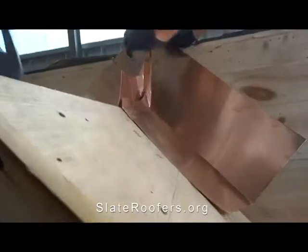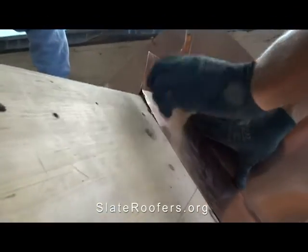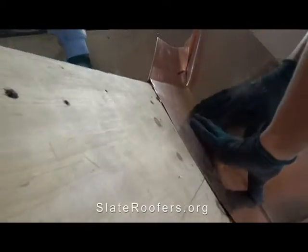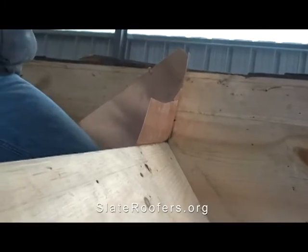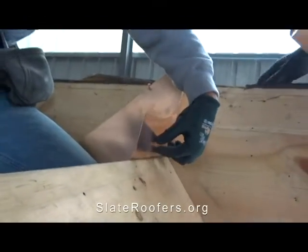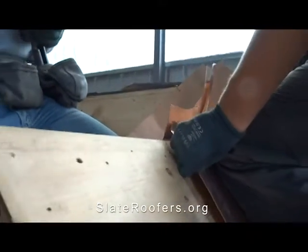You want to leave it loose. That first fold was seven-eighths; the second one's going to be oversized right now — as soon as we get that side on, you trim it. We'll scribe a five-sixteenths, so it's an extra five-sixteenths above the seven-eighths.